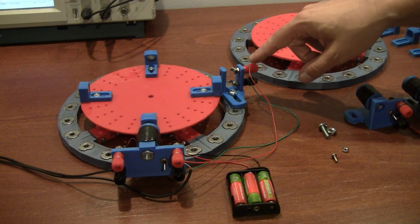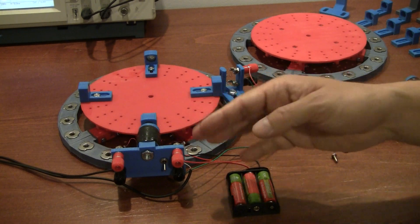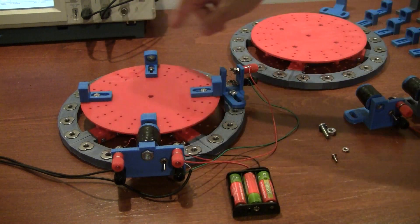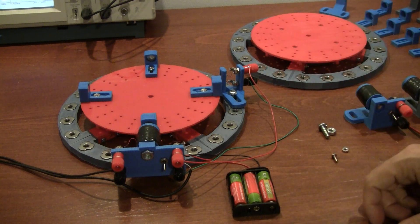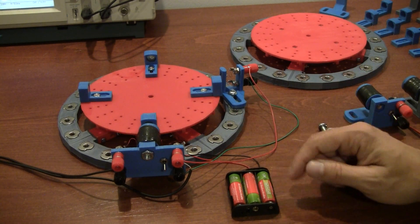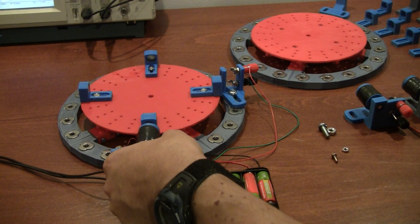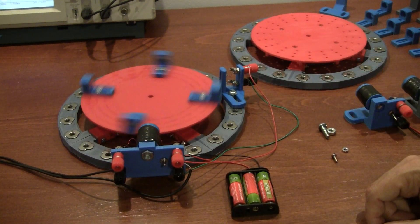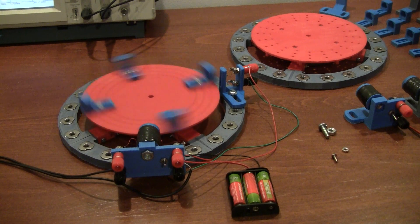It's going to actuate using the magnetic reed switch — it's going to trigger and energize this coil. We've got a trigger coil and a generator coil which is going to take an output signal as the magnets go by. This will demonstrate a lot of the different effects you see with Adams motors and Bedini motors — magnetic reed switch motors. It's designed to rotate at about 200 RPM on a fairly low voltage; in this case I'm using 4.5 volts. I've put a switch here to get it to start easily, and you've got to give it a bit of a push to get going. It'll get up to around 200 RPM at 4.5 volts.